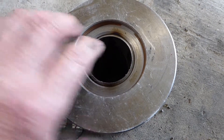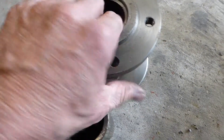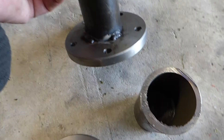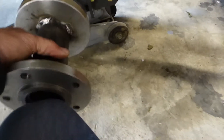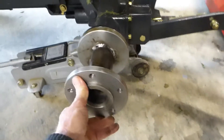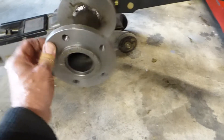Then I'll put a very fine bead of weld just around the front of that one, and another little bead of weld on the inside. These are only just tacked on at the moment, so I'll just finish tacking those on and then we'll see what the tractor looks like with a little bit of extra width on it — should run pretty true.